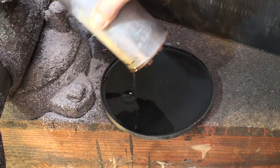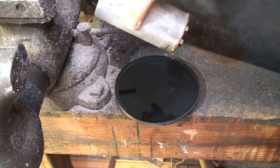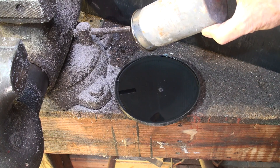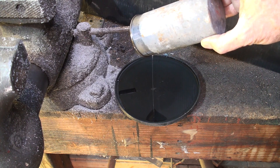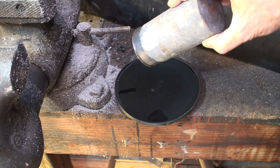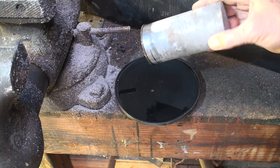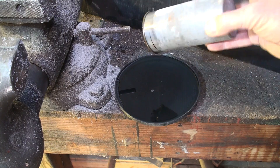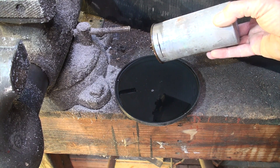What I'm showing here is a slot I cut in this capacitor, and you can see quite a bit of oil inside. This oil is used to cool the capacitor down. If you see one where oil is coming out through a hole in the capacitor, you need to replace it, because it's not going to cool properly — it actually sits in a bath of this oil.